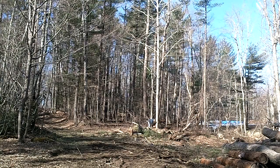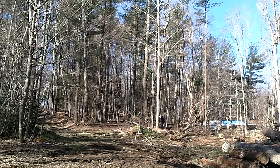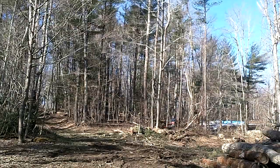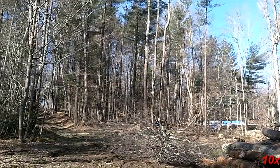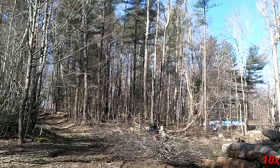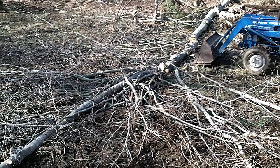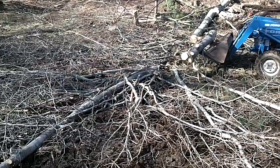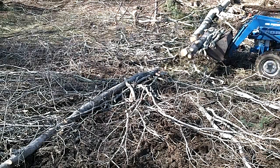The greenhouse is being constructed at the edge of a field. About one and a half acres needs to be timbered. Each tree needs to be cut, delimbed, and removed from the area — a very time-consuming process without the aid of large logging equipment. Having a tractor with forks helps to speed up the clearing process. All the hardwood logs and branches larger than a couple of inches are collected and stacked in a large pile. They will then be cut and split, and will be used to heat the greenhouse during the winter. The larger pine logs will be sawn into lumber.